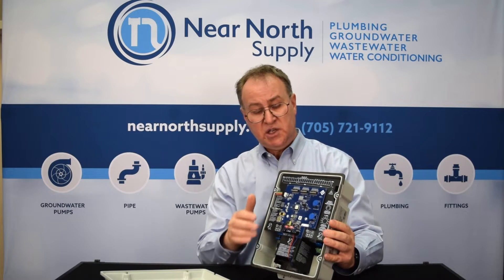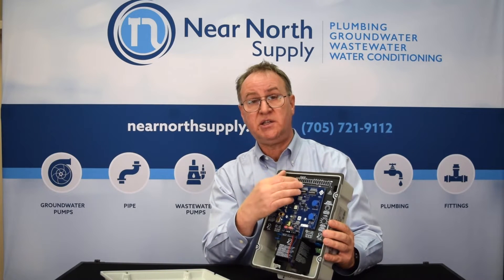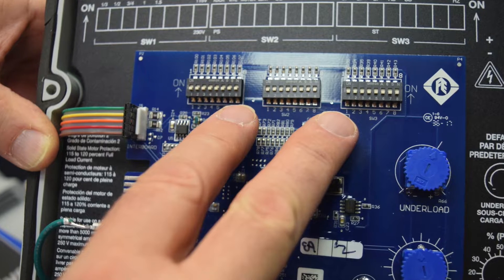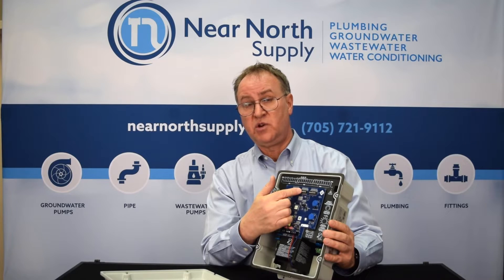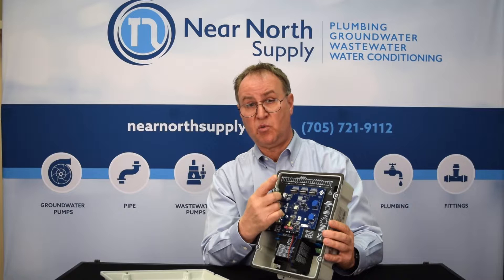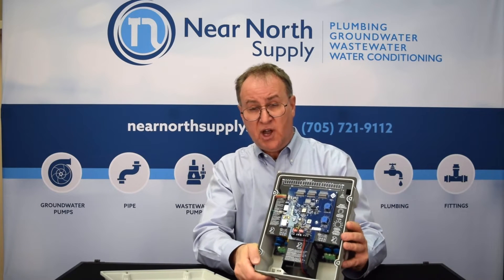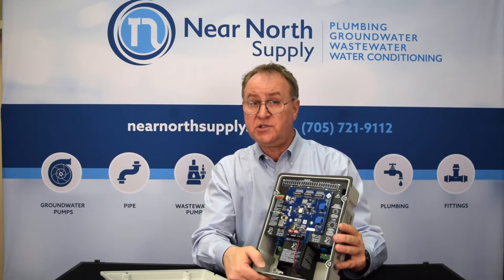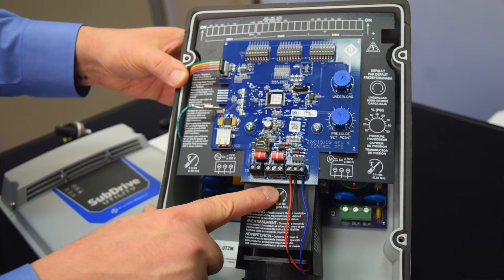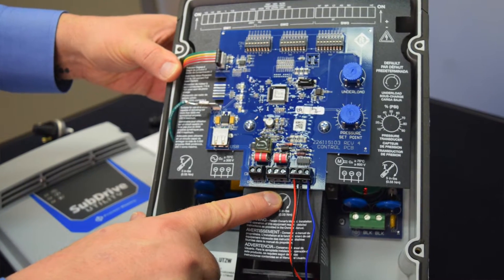In the case of a surface pump, you would set this according to the grid inside the lid of the box to the full load amperage, anywhere from 6.4 to 13 full load amps. The drive will run a 230-volt motor from a half horse to 1.5 horsepower. On 115 volt, the drive will operate a third horsepower submersible or a half horsepower submersible — that's a new feature. The drive itself comes with a pressure sensor, but the manufacturer has put in posts so if you wish to use a 4 through 20 milliamp transducer you can do that too.